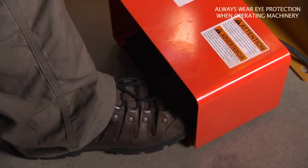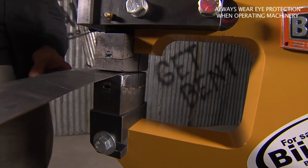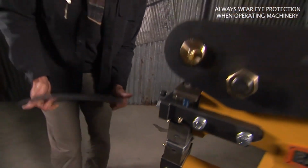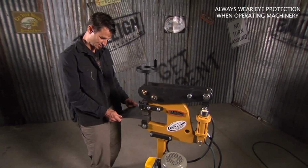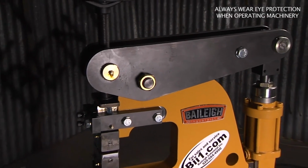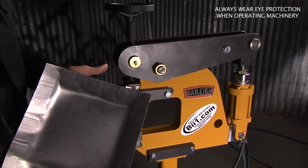And look at this thing, it actually eats metal, puts huge shrinks in a panel that normally, let's say you had a little kick shrinker, you would sit there and just ding da ling da ling da ling. Man, this thing really eats metal. Check this out. You can take a panel, shrink it down really fast. Look at that bowl. That's crazy. There's a lot of shrink.